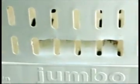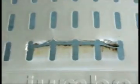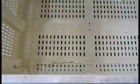This is a typical example of forklift damage to a jumbo bin. When there is damage to the corner pillars and base of the bin, it is not advisable to repair the bin, but rather to scrap the bin. This is due to the fact that all the integral strength of the bin is situated in the corner pillars and base of the bin.